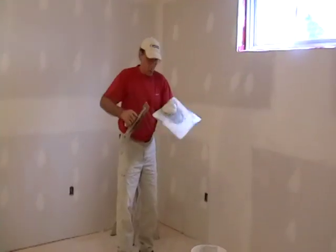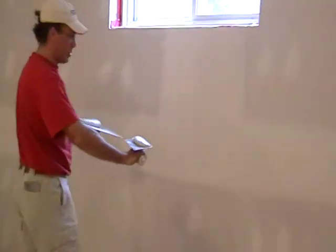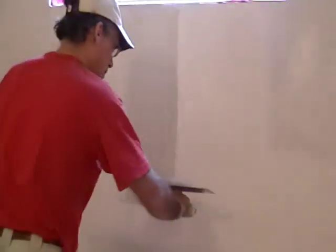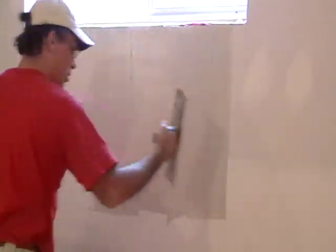Here's another mud control technique - moving the mud on. We'll start with this little short one here. Upside down, up it goes, load it up. And I'm going to go an inch or two wider again for the middle of the joint. Load it up and I'm laying it down as I'm going up. Then just make sure it's all covered.